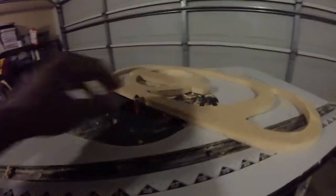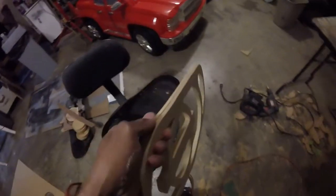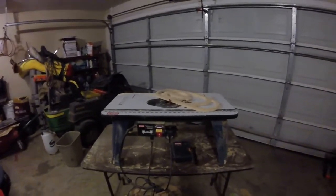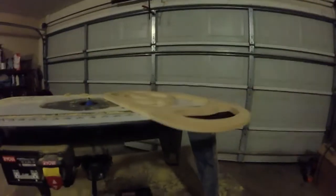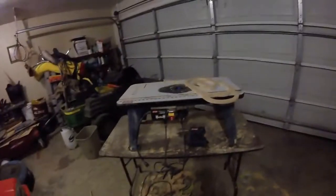Alright, so now the groove is cut. You can see it's just a slight groove, and now we're going to put it on the flush trim bit. This will smooth everything out and it'll officially be just a hair thinner all the way around than the old template. Let's go ahead and finish this off. Alright, everything is even - you can see the two tones, two different colors from where it cut twice, but it's even. Now I've got the 45-degree chamfer bit, so I'm going to trim and angle all of this inside stuff, and same for this piece. I think I'll be done with the router then.